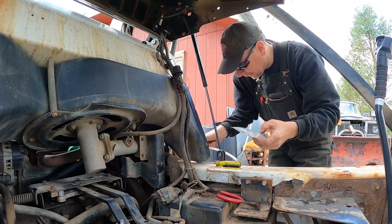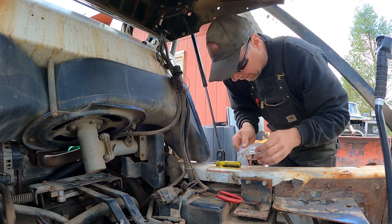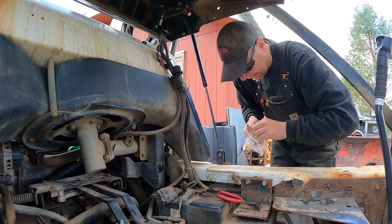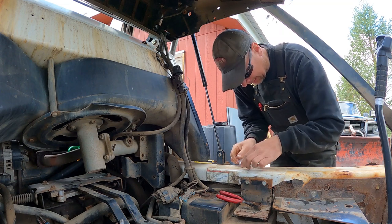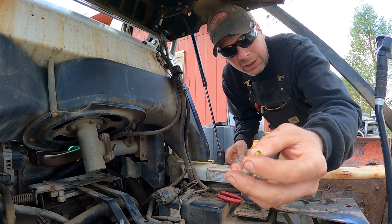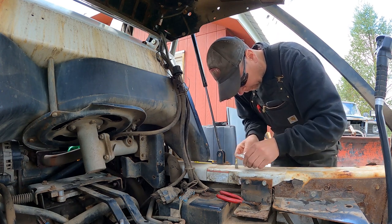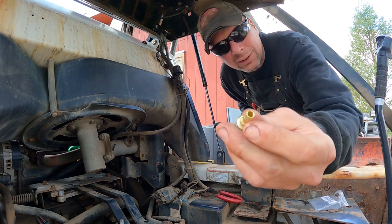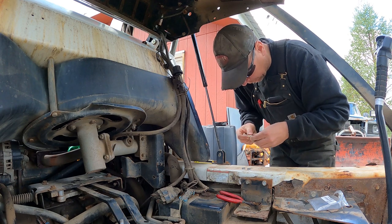I can see that. So my new fuel line comes with a line that goes in the tank, and it's got a screen filter end here, and it's got some little clamps that go on with the pliers here. So I'll open this up. This weighted screen pickup filter here keeps it on the bottom. There's a spring on that. It's got a check ball in it, so the fuel won't bleed back. So my friend just had a plastic pickup tube in there. I think the secret is there's a little check valve in this. You hear it rattling. I think you need to have the check valve to make this work correctly.